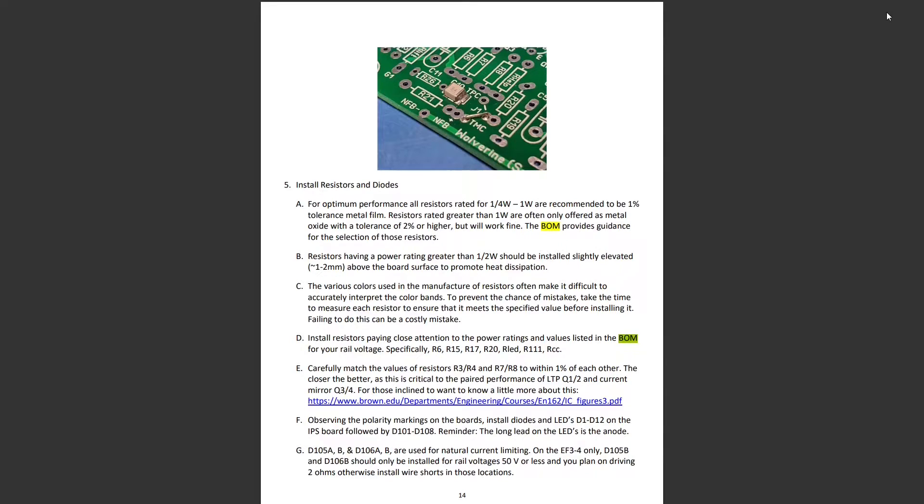You've got some choices to make: whether you go for higher or lower tolerance — in terms of what percentage accuracy you'd like — and the thermal specifications of the resistor. If you look at the resistor's datasheet, you can see how many parts per million per degree Celsius the ohmic value will change by.